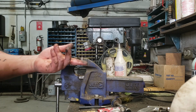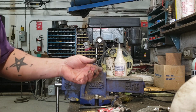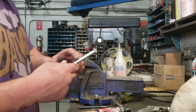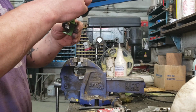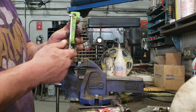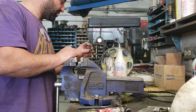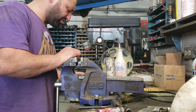And like I said, most cars will have a kit, and you can do this on the car. But if not, it's very simple. Get a grade 8 bolt, and make sure the shoulder spans across both sides. This one doesn't quite because I bought it for an older Ford, but that doesn't really matter. Maybe I'll switch it out and just go buy longer bolts. These are metric, so these are 10.9s, but grade 8s. 10.9s I think are a little bit stronger.